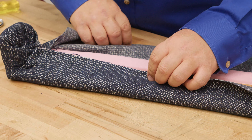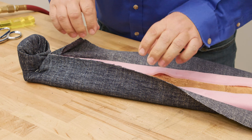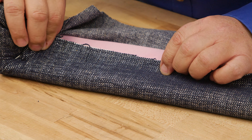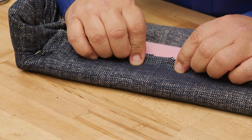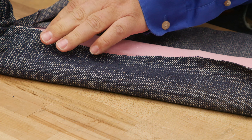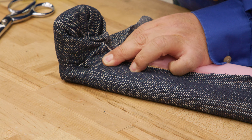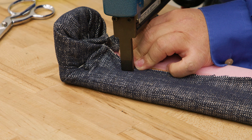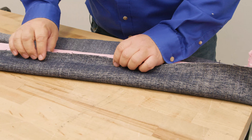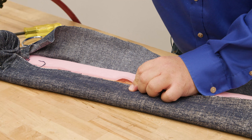There is a slight pattern to this fabric — I notice this side is longer because I might hem this back and staple it on top. I want to keep this pattern straight, so I'm going to check that it's straight as I staple it down. I'll put some preliminary staples in now and then add more in a little bit. The pattern should be nice and straight, and I'll secure this side with a little bit of pressure. This other side is not secure yet so we can use it to tension it even more.